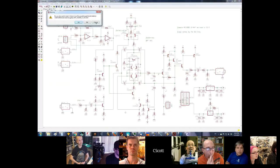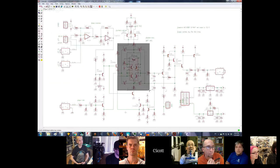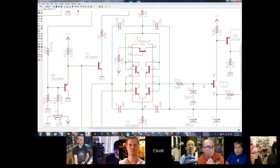But to finish off, in order to fix it, we just get rid of that capacitor by joining each base and collector together, so that you cannot have that capacitance there anymore. The only capacitance you would have is from the integral diode, and it isn't in the picture. It's reverse biased. It's the forward biasing one that was causing us the problem. It works. It now works perfectly.